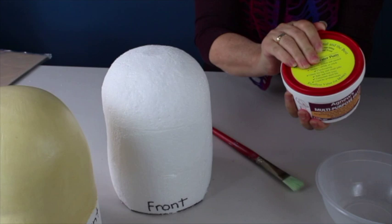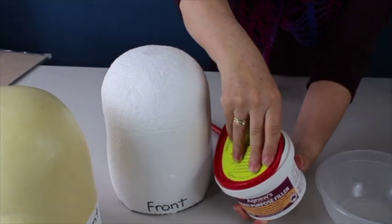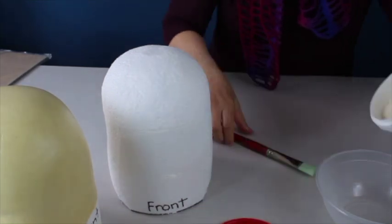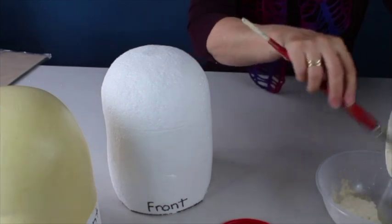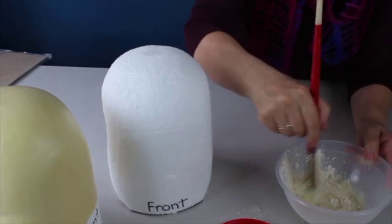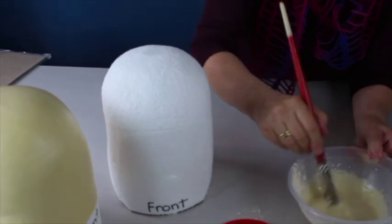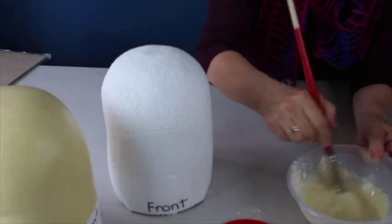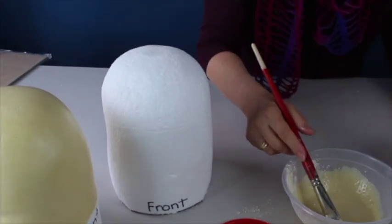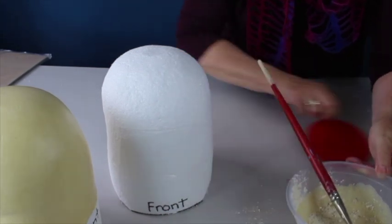Okay, just follow the instructions on this, but you want to mix up the wood filler until it's a consistency of about yogurt. Pretty simple. Try and stir it so there are no lumps and that all of the actual powdery substance is dissolved. That's probably a little bit thin. A bit more in. That aside.